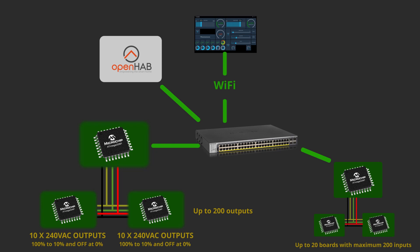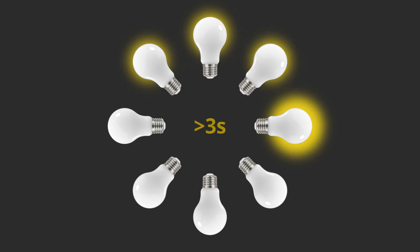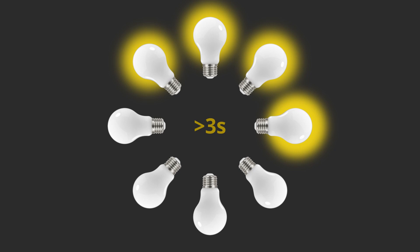My whole idea is to build a Lego-like system. There are a lot of small but similar blocks that, when assembled differently, give different functionality. And it has to be reasonably easy to take the blocks apart and reassemble them. For example, when changing the code on the slave board, it is possible to have different functions on one switch. Pressing a switch for less than one second turns on or off a specific light. Pressing it for more than three seconds might turn on or off all the lights within a given radius. Because the light switch isn't actually connected to the light itself — it's a separate block — I don't necessarily have to use it for a light at all. If after a while I find that I don't use the switch for switching a light, I could write new code and use it for the alarm system, radio, or the sprinklers.